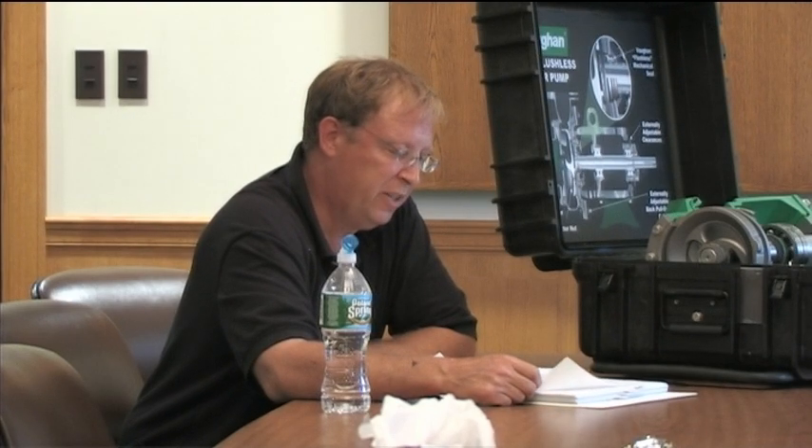These are all certified factory curves. In tab four there's a maintenance summary that gives you serial numbers and model numbers. If you ever contact Vaughan, the first thing they'll want is a serial number. These two pumps have the same serial number, just differentiated by a B or A as the last character. Tab four also gives you your lubricants - the types and quantities. Tab five has your list of equipment, all your spare parts which are here, and signed-over drawings.